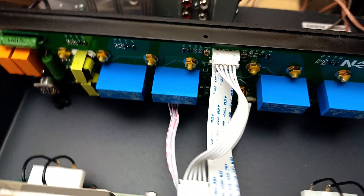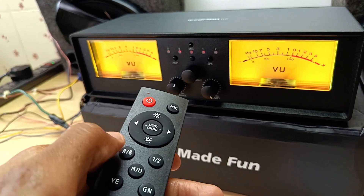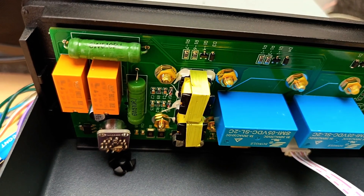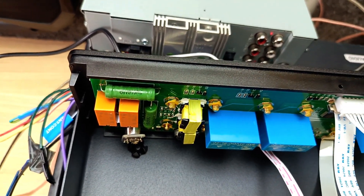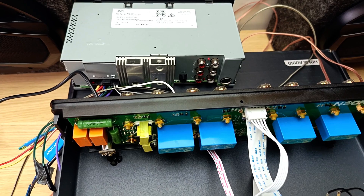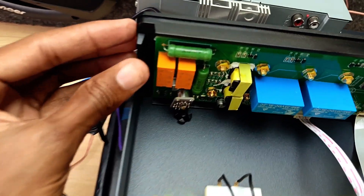I am honestly impressed by the level of quality in this product. I believe these are the relays that I could hear clicking. It has two sections — that's the front display with the VU meters, and at the back you can see where all the connectors go, a very big resistor, and the microphone. The Neo Hippo ET30 can protect your amplifier if no load is connected — meaning if no speaker is connected. These two resistors serve as dummy loads, so if the device detects amplifiers connected without speakers, it will automatically connect your amplifier to the dummy loads to protect it.